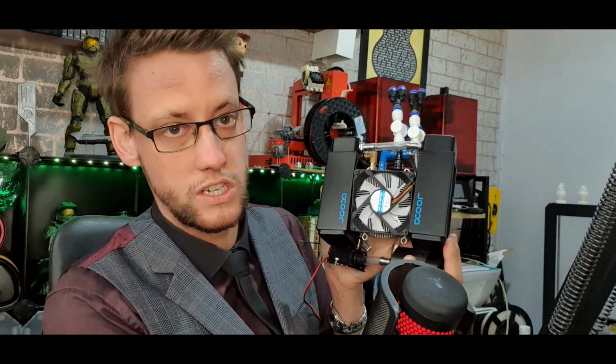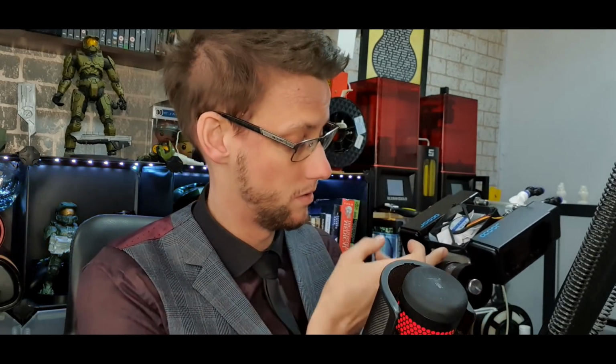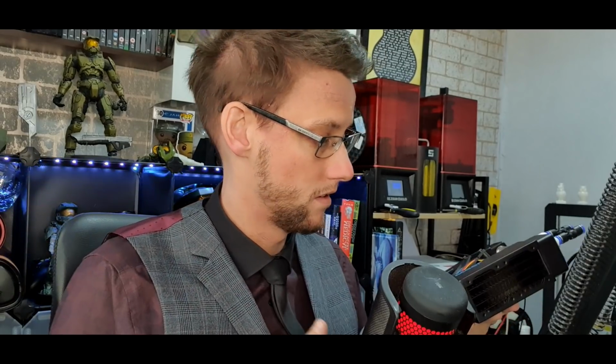I've managed to save on the amount of electronics that is required to get this thing to run, but this is the scaled down version. So this has two large radiator blocks here, either side, with no fans on them, it's passive effectively. This is going to be mounted inside of a casing system, so this one fan is an exhaust fan that pulls air out, which will pull cooler air across the heat sink to drop the temperature of the hot side of the Peltier pump. Because it's sealed within itself, the only way it can pull air in is through these. So these are passively cooled and allow the warm fluid that's been travelling around the suit to dump its heat into these radiators, and it be conducted and convected away. So I've saved a little bit of energy in regards to how much is required for this to function effectively.